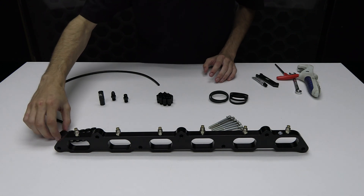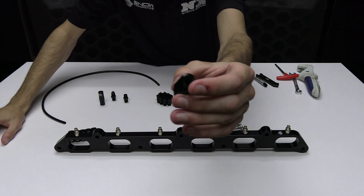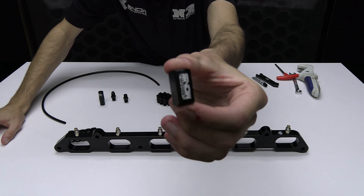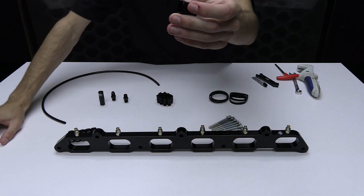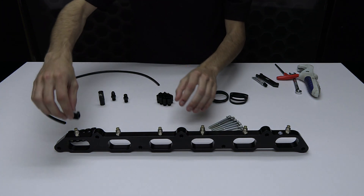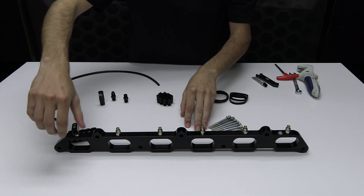After that, we're going to install the narrow 1/8th inch NPT 90 degree fitting and the five 1/8th inch T-fittings as shown. You're going to want to make sure you put E6000 on the nozzle holders before you put them on, and you want to make sure to snug them up, but you still want a little movement for putting the nylon line on.